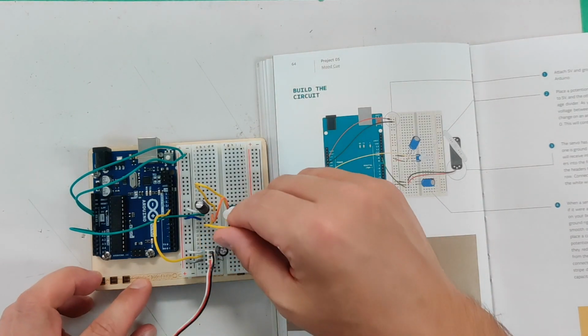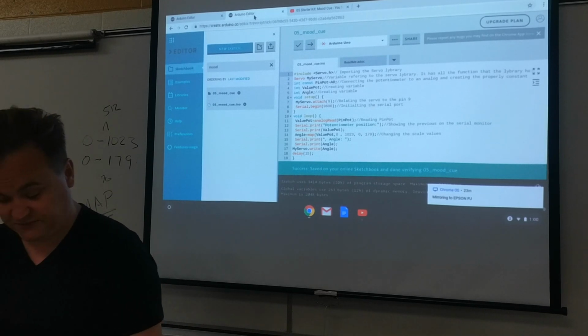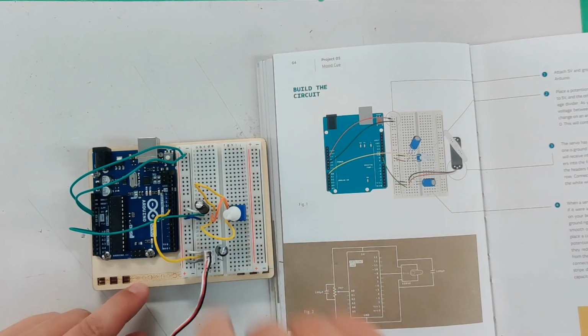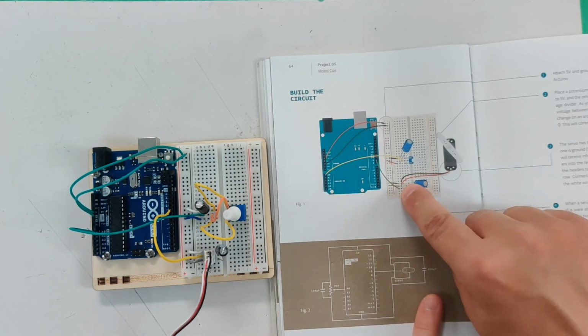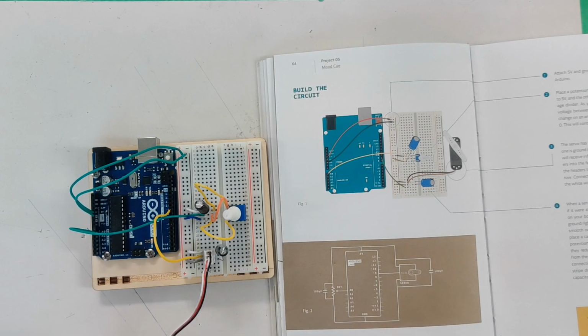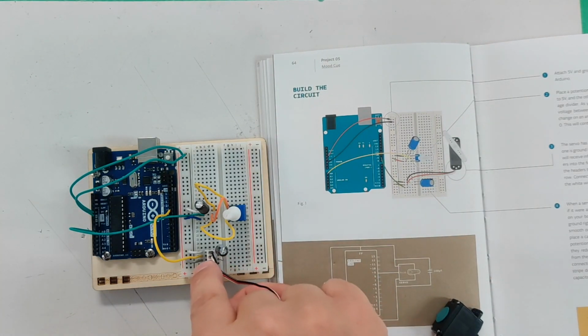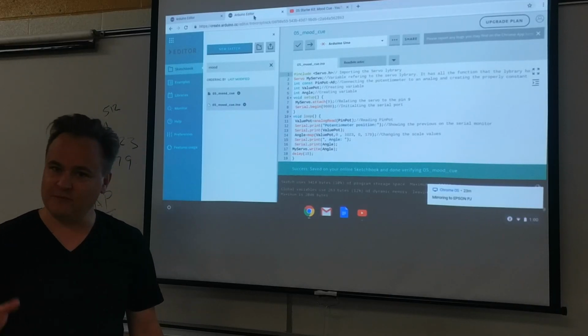The next thing, and this is in the video that I warned you about too, I told you to watch before you wire. Now remember, in your diagram, look at this. Black, red, white. But guess what? On most servo motors that we're going to be using, it's black, white, red. Oh no! You could be in serious trouble if you mess this up too.